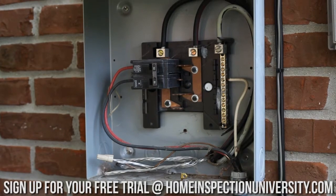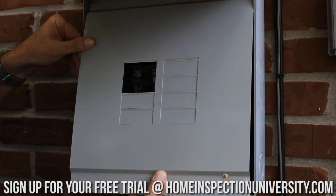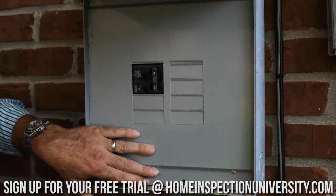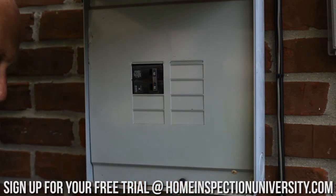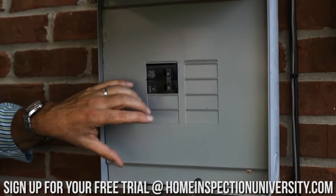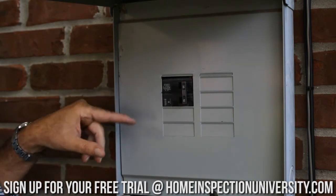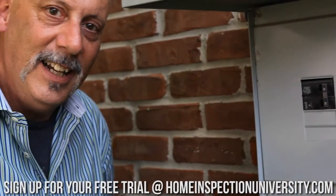So right here we're missing the stress clamp, and here we should have a bonded terminal bar similar to the one for the neutral, but it should connect directly to the box and be separate from the neutral — we always want to keep the neutral current separate from the equipment ground on any equipment downstream from the main service panel. We'll go ahead and put the cover back on carefully, trying not to hit any breakers because when they trip they sometimes don't come back on. Also, this circuit should be labeled — simply writing 'hot tub' would be fine, but all circuits are required to be labeled.